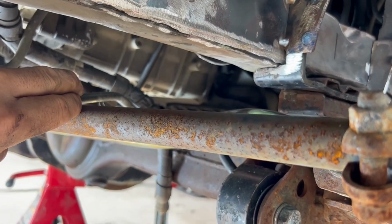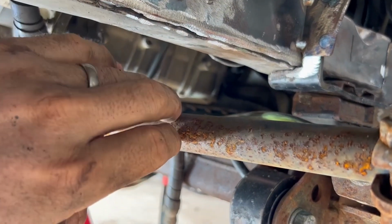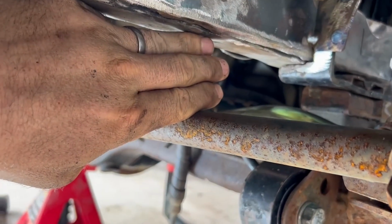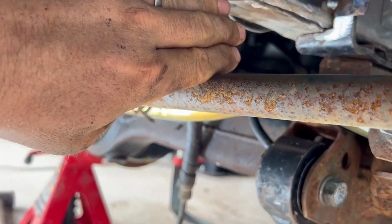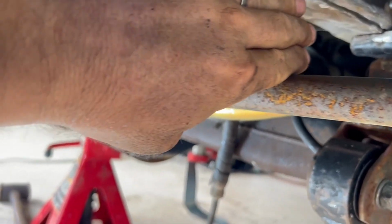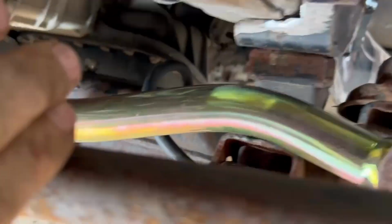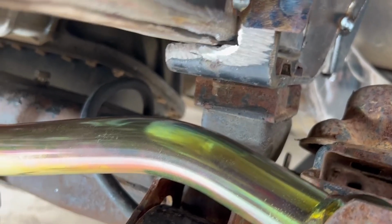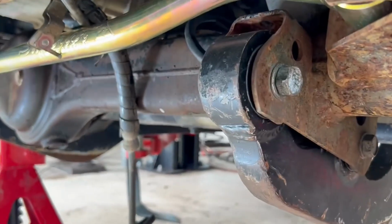I thought we might have had issues with clearance between the drag link and the chassis, but there is plenty of room there. When it's articulated at full compression on this side, it might get a little closer, but it's pretty well in line with the bump stop. So you can see the bump stop behind there, so I can't see it ever really contacting.